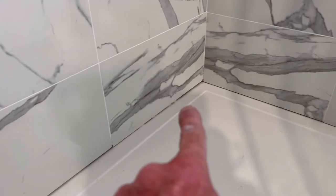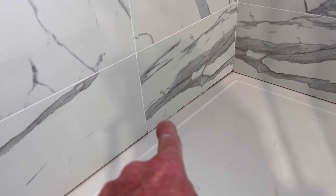It's key to get good results — you've got to prepare it right, because the slightest bit of grout or dirt or dust gets in the white mastic and it's game over. You'll have to get it out and start putting it back in again, and if it's started to skin over it causes all manner of problems. Especially in the shower tray — get a little brush under it and give it a really good brush out and hoover it as many times as you can. Because as soon as you start putting your mastic in, pull it all the way through and it'll just pull some dust out. I can guarantee it's happened to me. Make sure you prep it as best you can — any lumps, any dust.